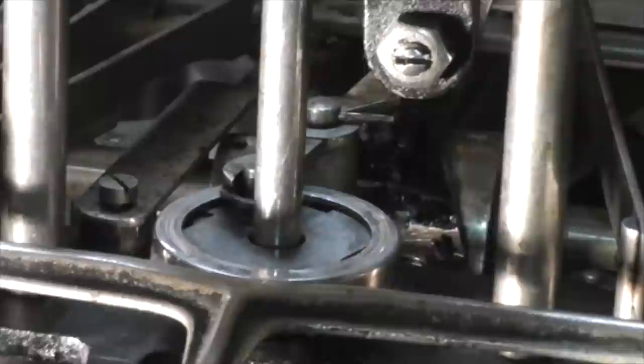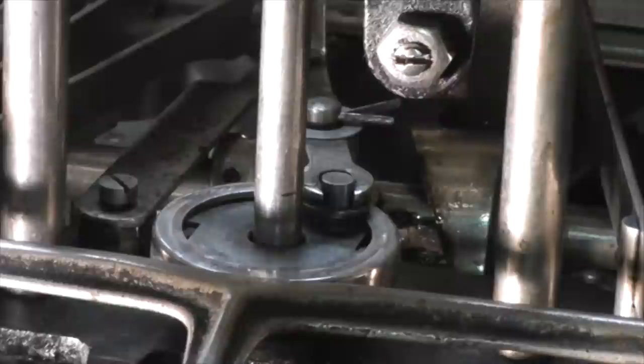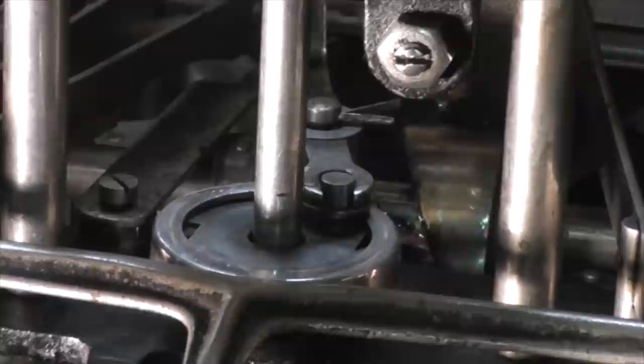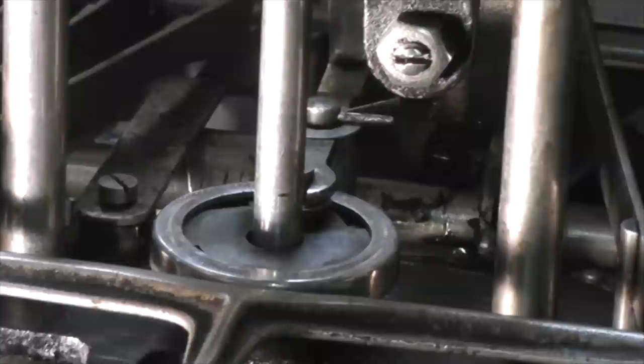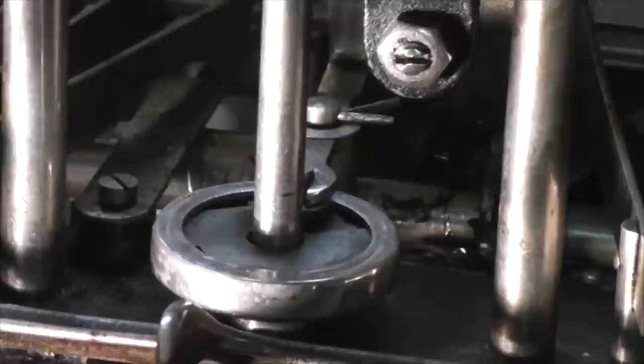And as you should have seen, the ratchet turned a little bit counterclockwise and then clockwise. And it'll go back to the at-rest position once it completes the rest of the cycle. Again, it is all controlled by that main timing cam. So if I move the wheel counterclockwise, whoops, I hit a winner. If I wouldn't have hit a winner, you would have seen it actually force that in the counterclockwise positions, because it's engaging the ratchet.